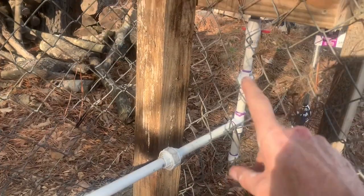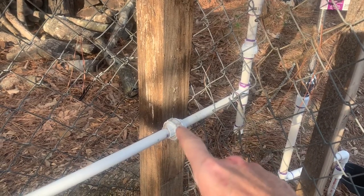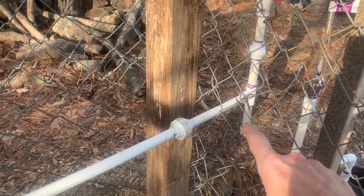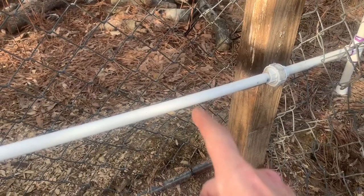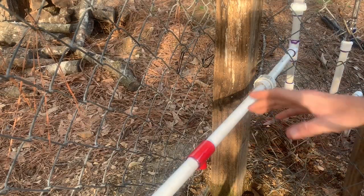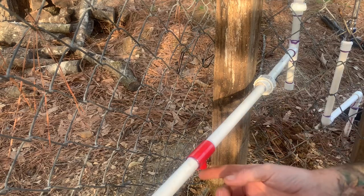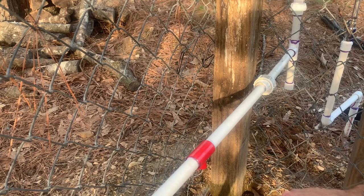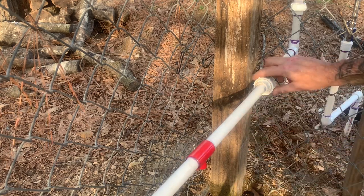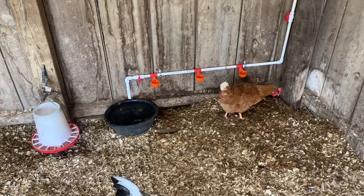We're inside the coop now. You can see it comes from our outlet — there's our bucket — it comes from the outlet with a union. I teed this off with another union right inside the coop, and I'll show you why this is important. The reason I teed it is you never know what you may need in the future. I put a cap on the extra outlet, but you don't have to. I'm going to cut this and put our nipples on here. I like to put unions right where I'm working by my nipple system, and I'll do this at every coop running down through here.